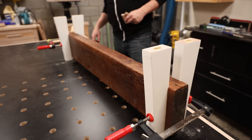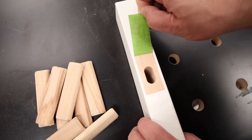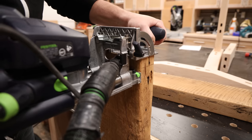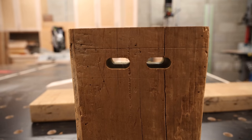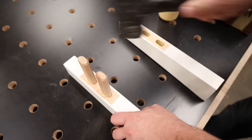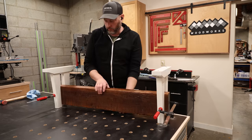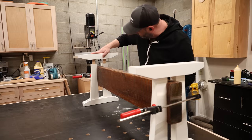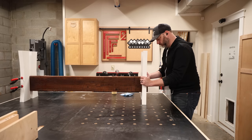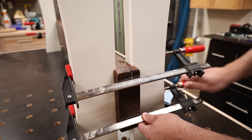With all the parts finished, it's time to bring this project home and assemble everything, starting with the benches. First I expose the mortises by removing the masking tape. These dominoes run through the center of the stretcher with plenty of wiggle room. I plunge two mortises through each end of the stretcher, cut shallow notches where the vertical portion of the legs will go, glue in dominoes to one side, slide them into the stretcher, add the other side, and clamp it up to dry. Then I add more dominoes to the ends and add the top and bottom supports. I'm relieved to see that all my planning paid off and these parts are all fitting together nicely. I repeated that same process with the table base, and I'm really liking how the stretchers appear to wrap around the legs.